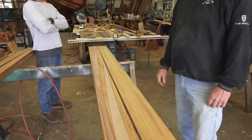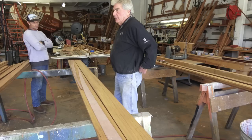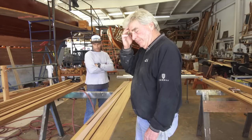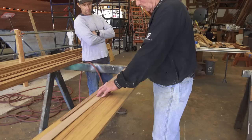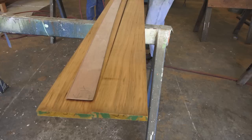The cabin. Yeah. Because they're wider than 2 inches. Well, they're wider, and you can't bend them in. Right. Because you can't get them out. Right. Well, you could, but boy, it'd be real risky tearing up the edges. So these are like a hull plank. They have to be spiled and sawn to shape. Gotcha. Not bent into shape. No. And from here on, if this is off a little bit, even on the real wood, it'll adjust itself. They're not completely unbendable. Right. It's just when you get back that last foot or so, it's 2.5 inches wide. So it would have a heck of a time bending in a short distance.